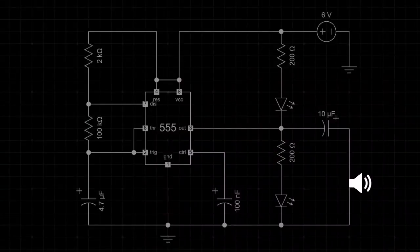Let's dive into the circuit and break it down step by step. The 555 timer is set up in a standard astable mode, meaning its output on pin 3 will repeatedly switch high and low. A 6 volt power supply powers the circuit. Pin 6 (threshold) and pin 2 (trigger) are tied together, and this node also goes to ground through the 4.7 microfarad capacitor. Pin 7 (discharge) connects to pin 2 (trigger) through a 100,000 ohms resistor, and from the 6 volt rail to pin 7 there is a 2,000 ohms resistor. These two resistors and the 4.7 microfarad capacitor form the charge-discharge path that sets the oscillation frequency.